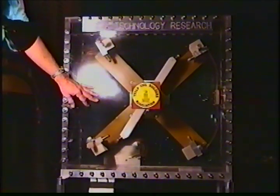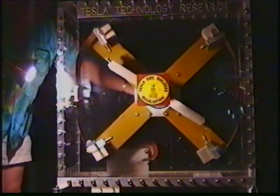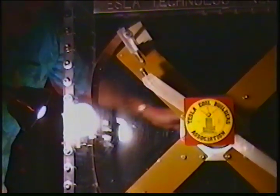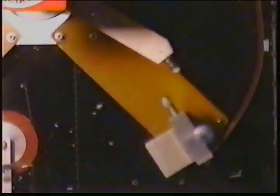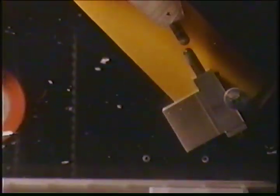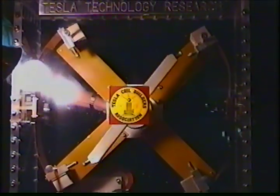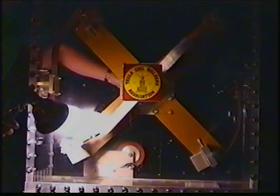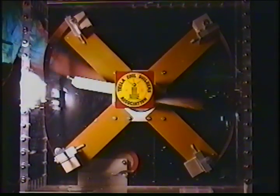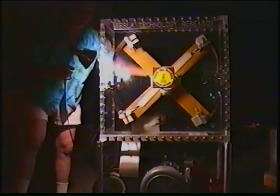As you can see if I rotate these arms, these are the rotary arms themselves. If you focus closely here in this corner, you'll see one of the four stationary electrode assemblies. As I rotate this around, you can see that the rotary arms come into close proximity to it — that's where a spark takes place. Following the circuit from lower right to upper left, it commutates there as well. Then rotate another 90 degrees and it fires between upper right and lower left. So it fires twice every revolution of the rotary arm.